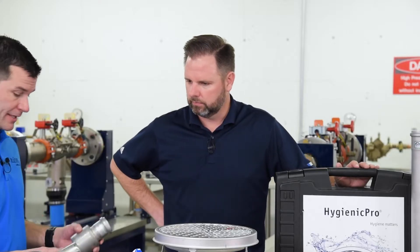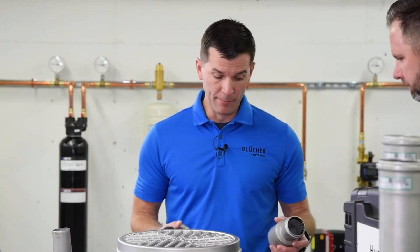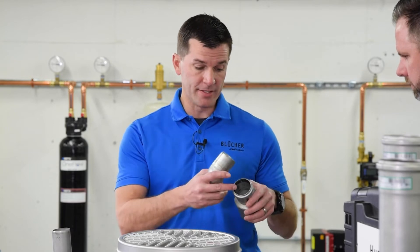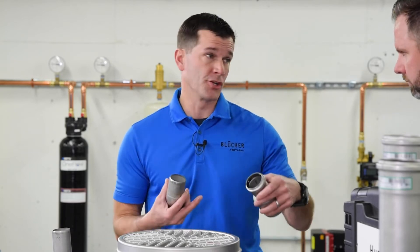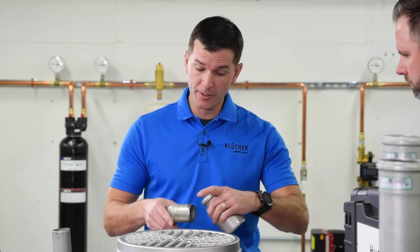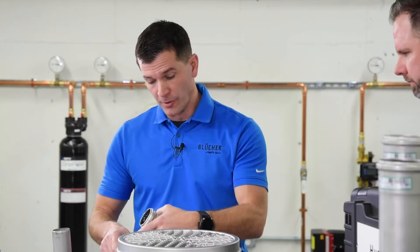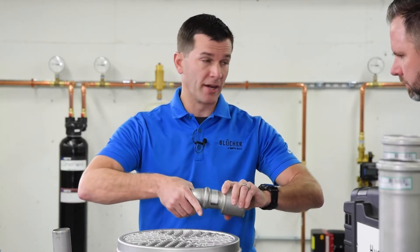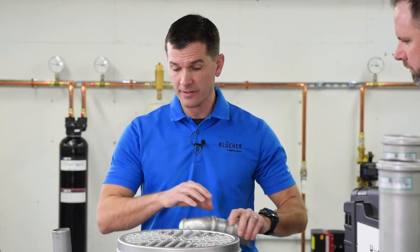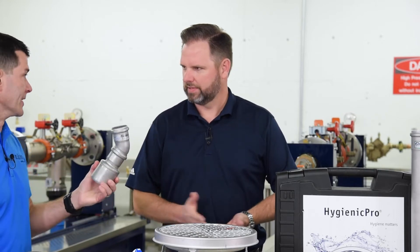One of the big things from a contractor is they haven't used it before, so that's kind of getting over that early. It's a new product, but simply what it is — it's a spigot and hub design. You have a gasket that's compression-based, so you're popping this in. You use a joint lubricant, which is a water-soap-alcohol mix. You spray on a little lubricant, put it right on the spigot end, and push-fit through with a little twist back and forth motion, so you're getting that lubricant through the gasket and around it. That simple.